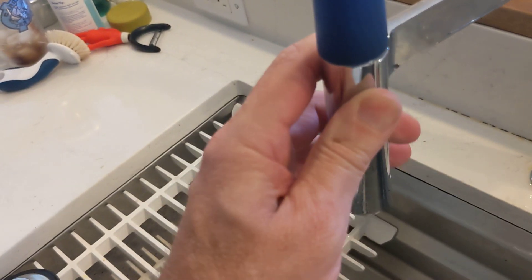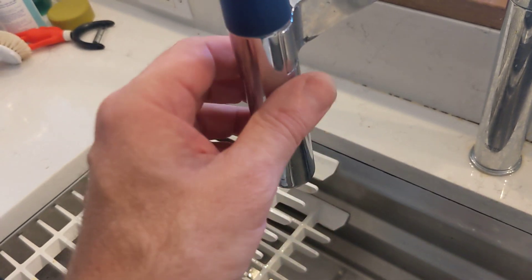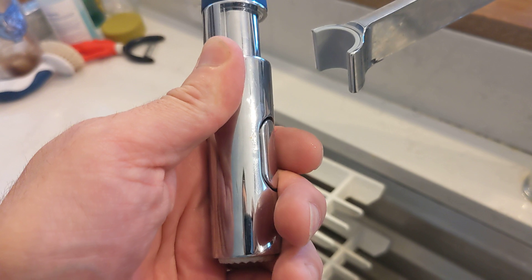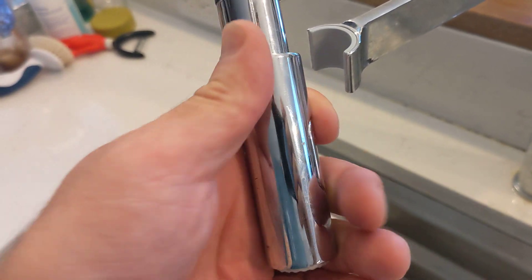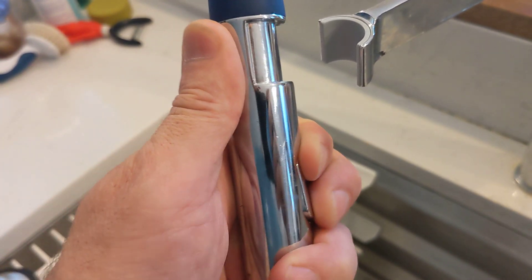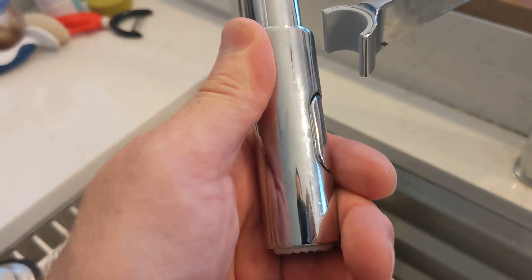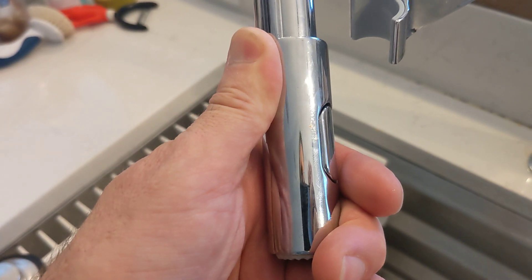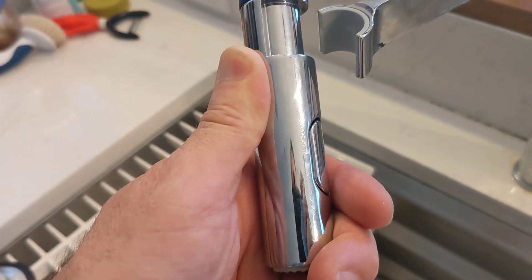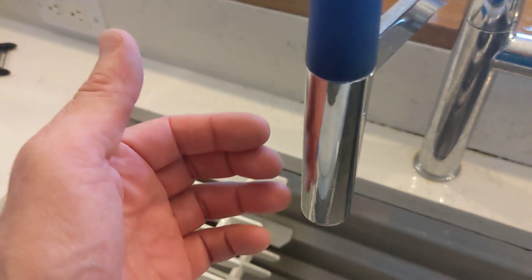There are different materials, different recipes if you will, for the magnetic material in here, and they have different Curie temperatures. What we want is the highest possible temperature magnet. I'm hoping somebody in purchasing said we can get a cheaper magnet with this different number — same force — but they didn't pay attention to the Curie temperature and got something a little lower. Unfortunately, the other one I did take apart a couple years ago — those cartridge pieces — by recollection, it is not something you could take apart and reassemble. There are some truly one-way assemblies, clips that when you snap it together are hidden, so there's maybe no real way to change the magnet out. The unfortunate side effect of super cool, sleek aesthetic design is that you don't have room for screws and snaps — like the iPhone and basically all phones and laptops being put together with adhesives now, which makes that much harder.